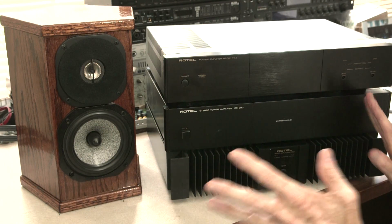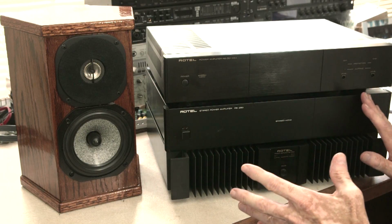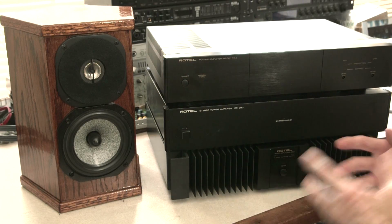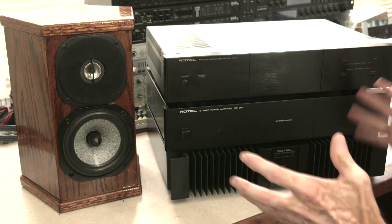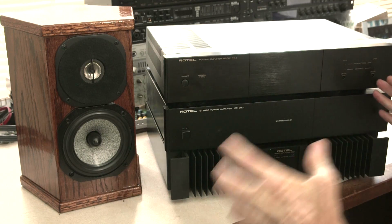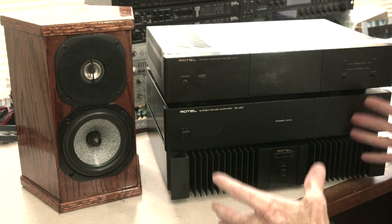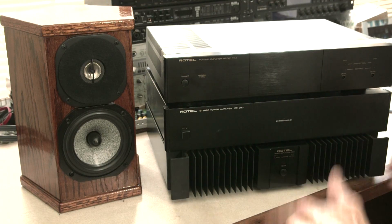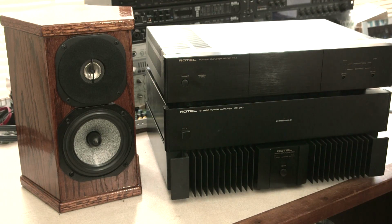He's the brilliant electronics engineer. I'm not an engineer in electronics. I was more in the mechanical things. That's my gift. So I relied on him, and he's long since passed away, so I don't have his brain to pick anymore. But anyway, he designed us tube amps, my brother and I. We built tube amps with 3 stages of 12AX7 or 12AU7, depending on if you want to drive the stage a little harder, and then push-pull 6L6 output.